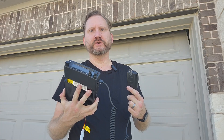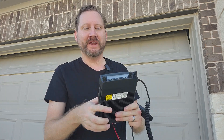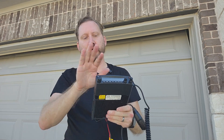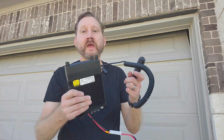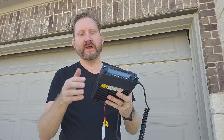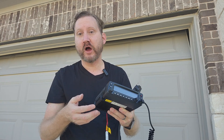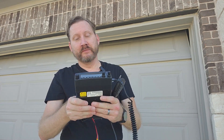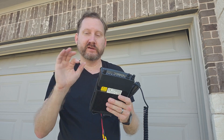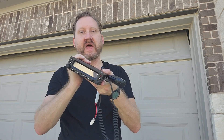The remote head feature is also really nice if you're wanting to build one of those ammo can repeaters — you know, where you take two Baofengs and link them together. Since this has a crossband repeater function, all you need is one radio. You can detach the head, use the extension cord to put the faceplate on a control panel, and bury the radio inside your Pelican case or whatever. Just make sure you turn the power down — at full blast this thing will pull like 15 amps and small batteries don't have enough output capacity for that. So use the right size battery or knock your power down. Using this as a repeater is far better than trying to link two Baofengs together — by going crossband you only need one antenna and one set of wiring.